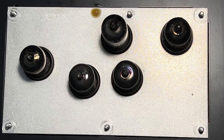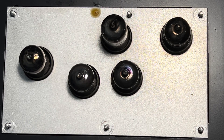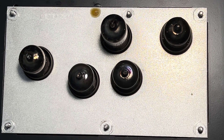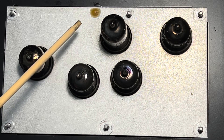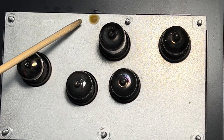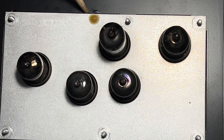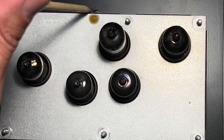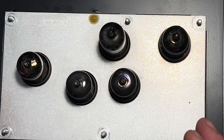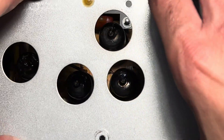All right, so we are looking at the little cover plate which is situated over the preamp and the reverb tube section. And you can see this — it's a little bit of wax. It looks like this little drip developed from the melted wax pouring onto the opposite side of this plate, and then obviously running down and cooling off. Let's find out what that is. Obviously it's going to be related to a capacitor — let's see. And it is.